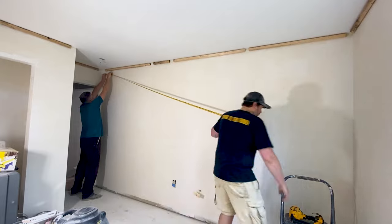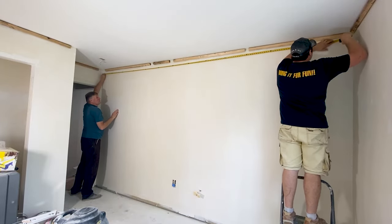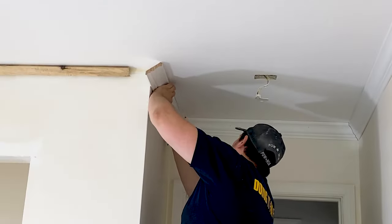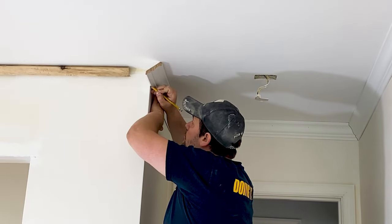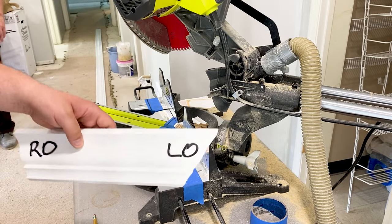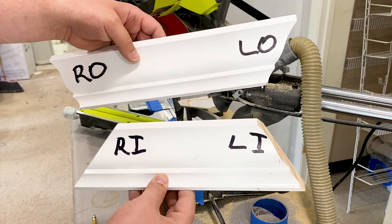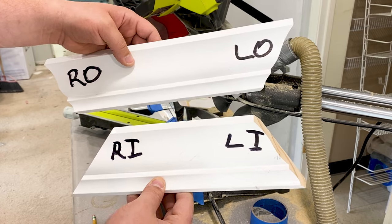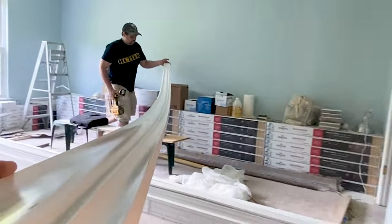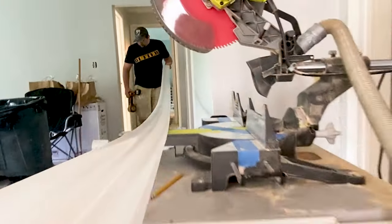Now that we have the spruce installed, let's go over how to measure pieces. You always want to measure about two inches below the ceiling from wall to wall on the inside corners. As for the outside corners, mark the length you need on the molding piece itself to get the exact fit. To make the cutting process easier, I created some template pieces. When you first start cutting this stuff, it's like playing 3D chess, but you'll get the hang of it after a few cuts. Check out the video in the description to see how to cut molding if you've never done it before.